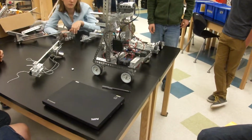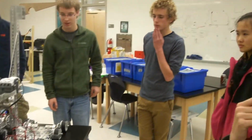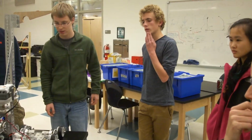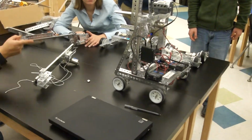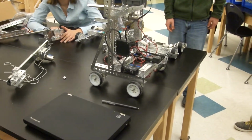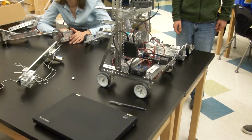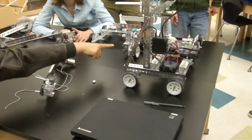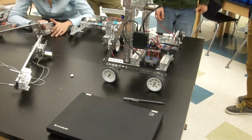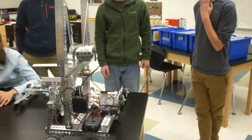True driving, right? This also changes the turning axis. This one would probably turn better because of the rear only wheels. This one would have more wheel skid. In fact, it's called the skid steer drivetrain because the wheels skid when you steer it. Though you could always move the back 2 to the omni wheels and still drive them. There's all kinds of ways.